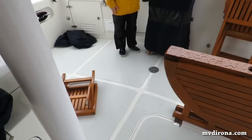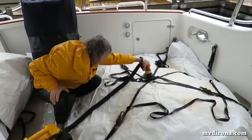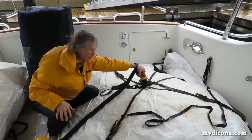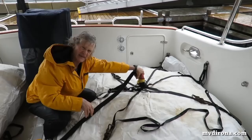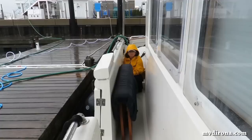The final stage — we'll set bladders out, 300 gallons each, one here and one there. Tomorrow we'll fuel up, and sometime between tomorrow night and Sunday morning we'll head off to Kinsale, Ireland. We're just filling up the bladders with air so we can position them to make sure they're centered up properly. Once this is done we'll suck them back down and then fill them tomorrow. It's hard to get them exactly right when they're folded up. For the forward bladder, it's vital to position it correctly first.